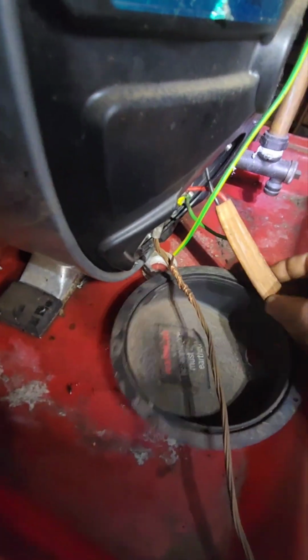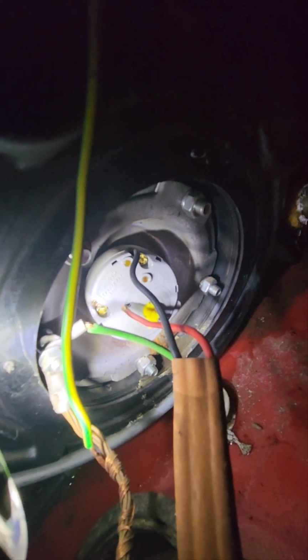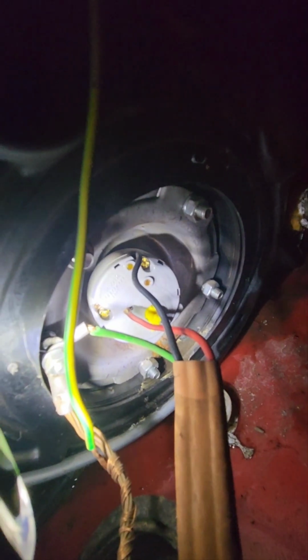It's a very interesting flat cable, this. I love that. The live wire came loose when I pulled the wire, which means it wasn't tightened properly, and that's probably why the geyser doesn't work. I'm going to retighten the live wire, because if a wire is not properly connected, it ends up shorting, and then it causes a problem.